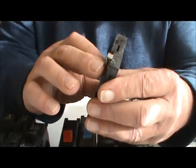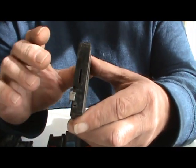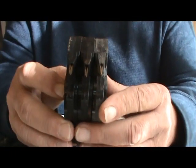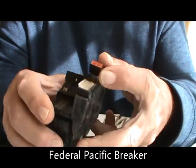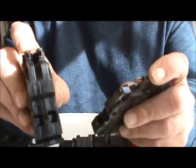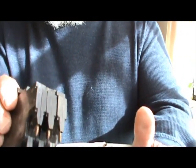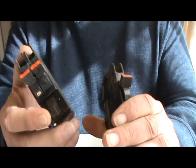This is a real curious breaker — it's got a side thing on it and a stop that says don't go in just anywhere, because your panel box has to be large enough to hold the circuit. That's just a single-pole 20. This is a real interesting one — these are no longer in business, been out of business for a long time. It's called Federal Pacific. This is a two-pole 30 and this is the one-pole 20. They snap onto the back and they've got stabs that go down into the holes. These are no longer used — they're kind of outlawed, taken out of business, and sued. Challenger makes ones to fit it. They sell them online for like $2 an amp, so this would be about a $60 breaker.